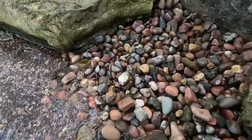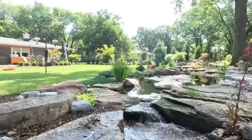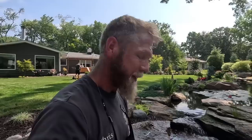The reason I say that is when this area gets all clogged and the area behind me, what'll happen is water level will continue to get drawn by the pumps down through the reservoir. Water level in the basin continues to elevate. And what can happen is you can develop a low edge simply by driving water level up, and the water will end up discharging out over the liner instead of getting back down to the pumps the way it should.